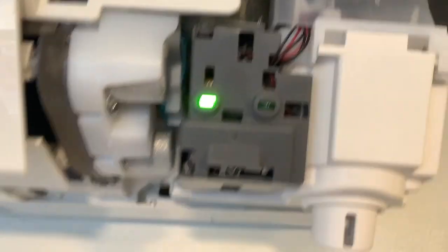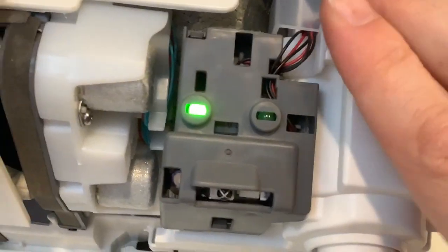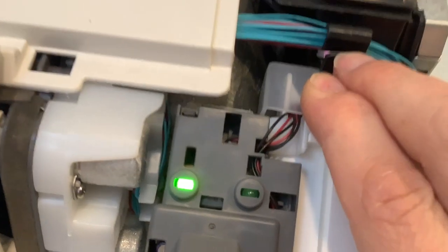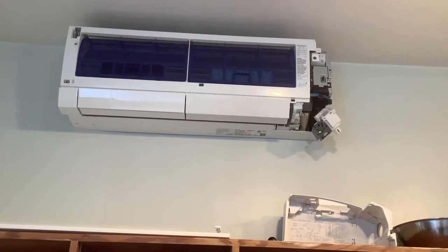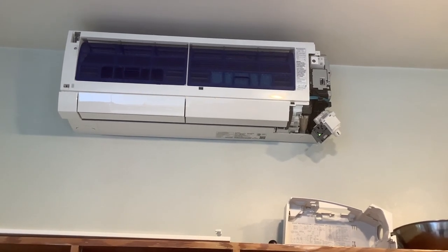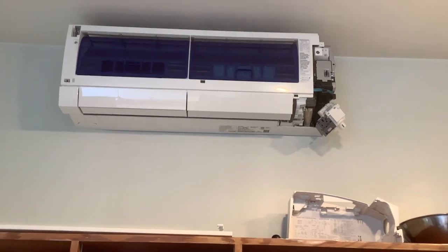The IC sensor is still attached at the bottom by its wire. You can see we've exposed these metal-looking plastic plates. The IC sensor is its own little piece with a black clasp at the top holding it on, and a little click at the bottom right. You can sort of take it off and it'll swing free — it stays connected by its wire throughout this project. Next we're going to remove the screws on this side plate to release it.